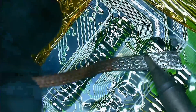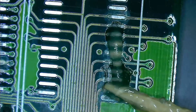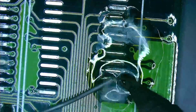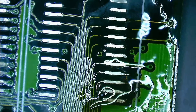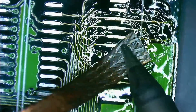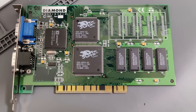Now that the memory ICs are off the board, I can clean the pads in preparation for the memory sockets. This area here looks like a massive headache. The corrosion has gotten between the memory pins and the board pads, covering them entirely. If we caught the corrosion in time, we may be able to restore the pads. The process I apply is quite simple: apply fresh solder and gently scrub over the corroded pad multiple times with a soldering iron, then use a wick to remove the solder and repeat the process. With each pass, more solder gets stuck to the pad. To my surprise, I was able to successfully recover all the corroded pads using this technique. I also noticed discoloration next to the pads where the solder mask covers the copper traces — the corrosion had spread there too. A few passes with a wick remove the thin layer of solder mask and expose cleaned copper, which we will cover again later with fresh solder mask before adding the memory sockets.